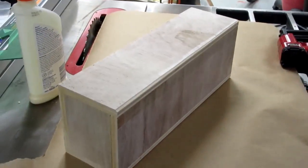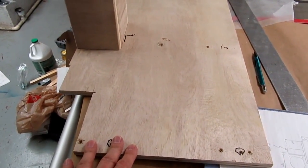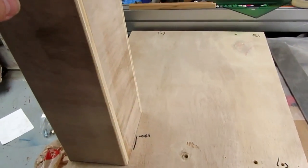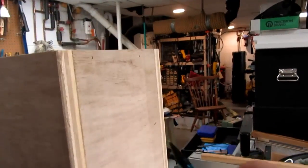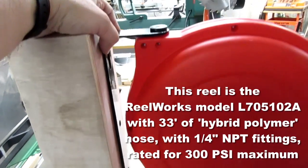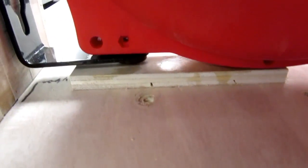Here's the box after the glue has dried and I've given it a rough sanding to take the edges off. I've got a test fitting here — my top plywood board is notched out for the leg of the table, holes are drilled through, and I've got this test-placed to visualize it. Now I have to put my brass threaded inserts in here, and I'm just test-fitting the reel to get the vertical alignment of the holes, with it placed on a block of wood for a bit of clearance.